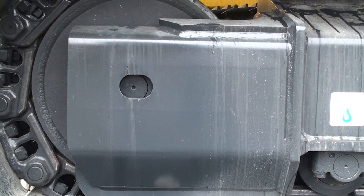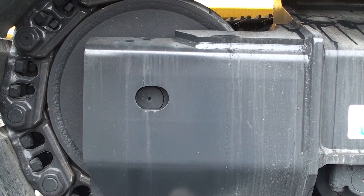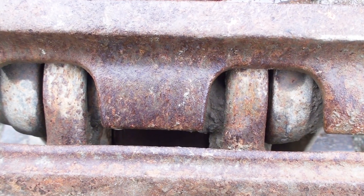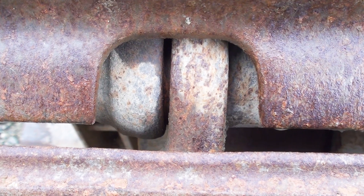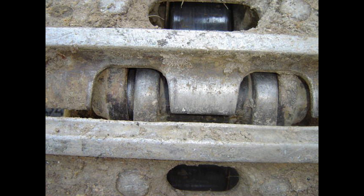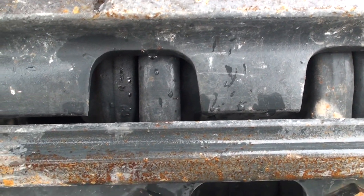In general, when the front of the front idler support block reaches the end of the track frame, the internal wear of the pins and bushings is about 100%. Over time, the fit between the track links and the pins will loosen and the links will start to spread on the pins. This can be seen by looking at the joints as the track turns over the top of the front idlers or the sprockets. Here is the track where you can see the bushing between the two links. New chain links will be tight against each other.